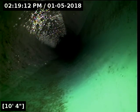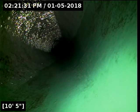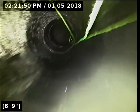I'm going to pop over the top of this real quick, and I'll do my locates right here at about 10 feet out. Alright, I've located here in the front yard area. I've marked with a big white X, getting it around 9 feet 6 inches deep. It's down there a ways. This thing just does a straight drop off immediately. But again, I do recommend a repair there to fix that. It's a very significant offset. Apart from that, the rest of the line is looking good and flowing very nicely and is in good condition. That one joint there, though, does need to be fixed. I would highly recommend it anyway.